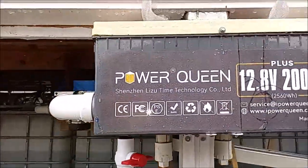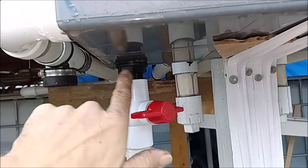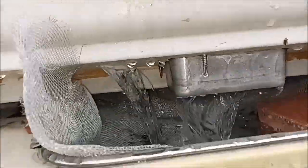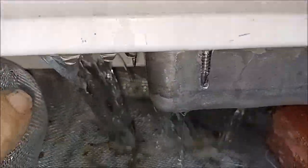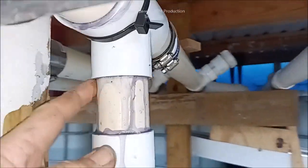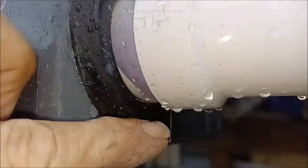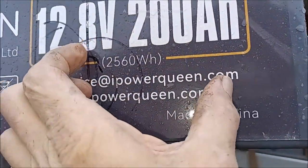Here's the cool part — I'm going to walk out here in the rain and get wet. Hold the hand over this — it's a Power Queen, guys. You can see here this is the clean-out; that's a flush-fit fitting that goes up in here. There was so much rain that the little four-by-two would not handle it, so I popped another hole in there. Here's all the plumbing. This design is a silt clean-out — the silt will go in here, heavy metals and other things will go in here if any get in. We are three-quarters of an inch at flood stage above this, and I'm going to show you what's on the end of these pipes.